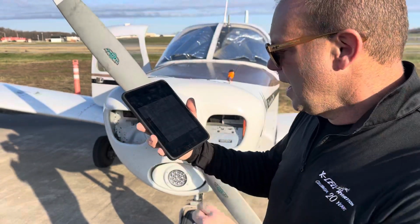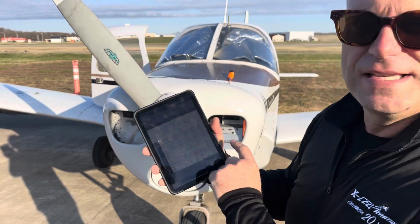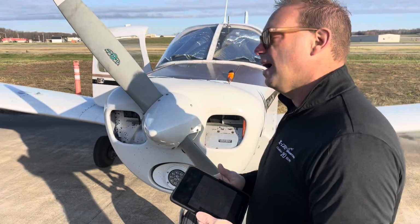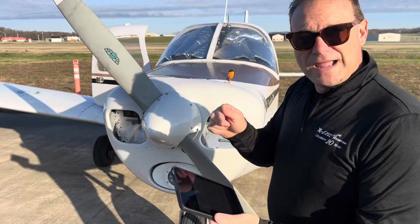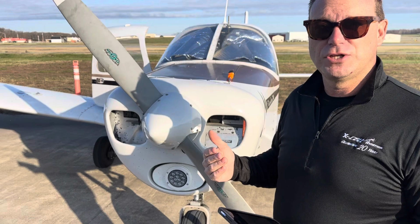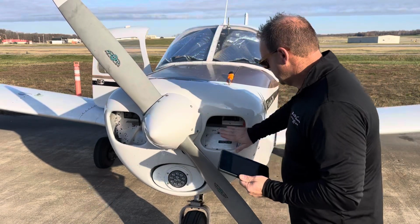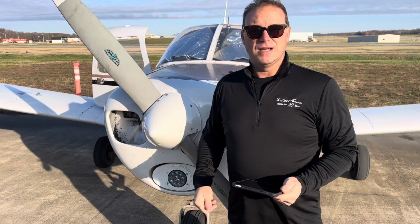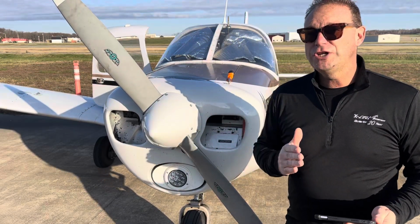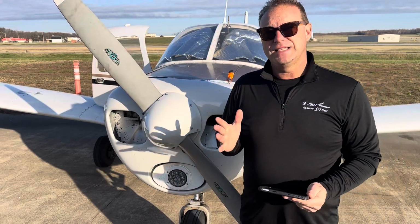It is a little chilly, but lo and behold, it's going to go up to 57, 58 degrees today. So I know, number one, it says right in my checklist, oil cooler plate 40 degrees. So that's our operational temperature that we're looking for, 40 degrees. If it's below 40 degrees, you want that bad boy on. If it is above 40 degrees for any portion of your expected flight, it should be off. So that's another big key.